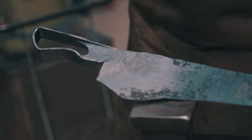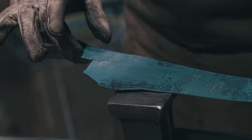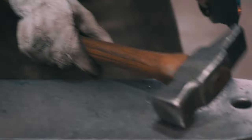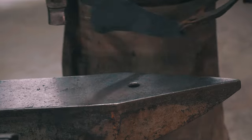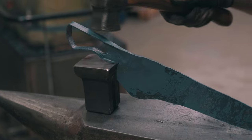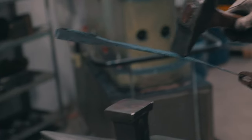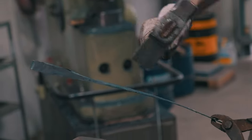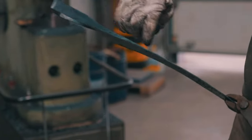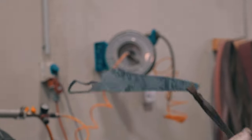It's got an easier solution. The problem with this one is the handle is tilted up and I want to move it down. I could try to forge that part, but I'm not getting in there well enough without deforming the handle. So what I'm going to do instead is draw the material on the back out a little — the material will expand in that direction and move the handle down. I've got a lot of material left there so that won't be an issue, and it should solve the problem. We'll see.